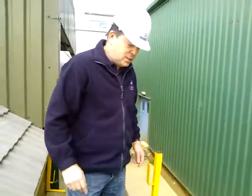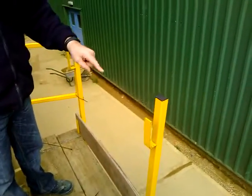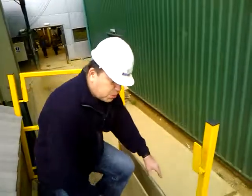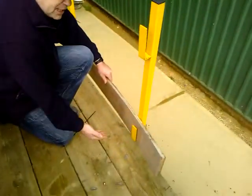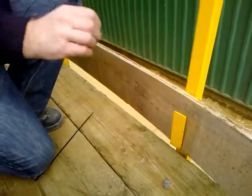Let's look at this: there's no handrail — there should be 2 handrails. Look at the toe board and the condition of it. Look at the gap underneath it. Remember, you need to spot these mistakes when you go on a scaffold because they can keep you safe.